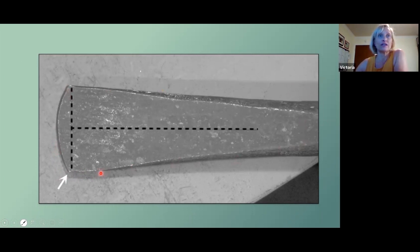you're done with your chisel. And the only thing you want to make sure is that you kept the growth the same on both sides, and you would measure from your shortest corner. And when I say shortest corner, what I mean is these might not line up the perfect distance away from the hammer end of your tool. So the shortest corner is what you'd want to use to make sure you've got the right dimensions here.